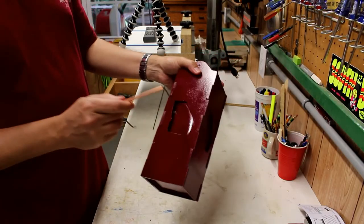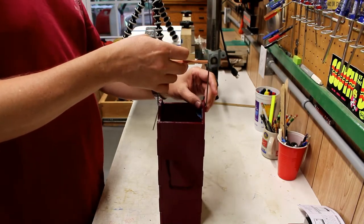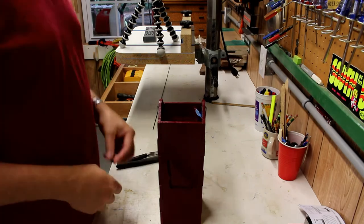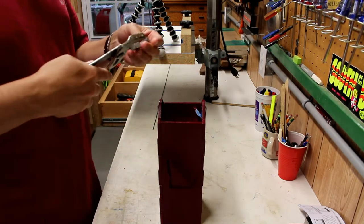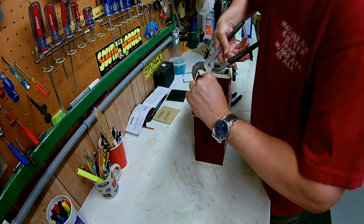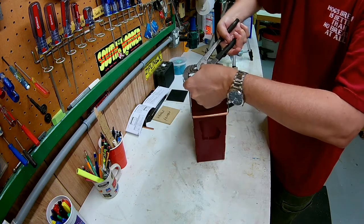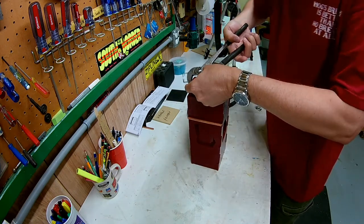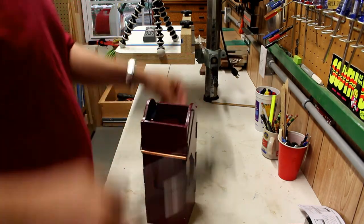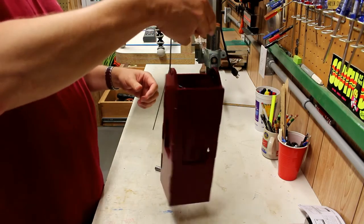So now I have the handle and the box still has some masking on the inside. I'll show you how it goes inside. The piece protrudes a bit, so I'm going to take the channel locks with a little piece of metal, open them up, put the metal piece against it, and squeeze it shut — that way I don't damage the inside when I close it. Clamping it in there really helps hold it and ensures it's not going to come out. Do it with the other side as well, and in the end it's fastened on, not going to come out, and the bottle of wine still fits in very nicely.